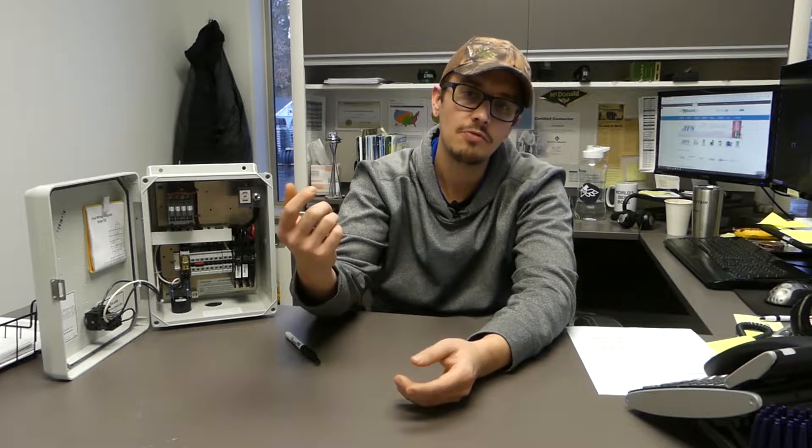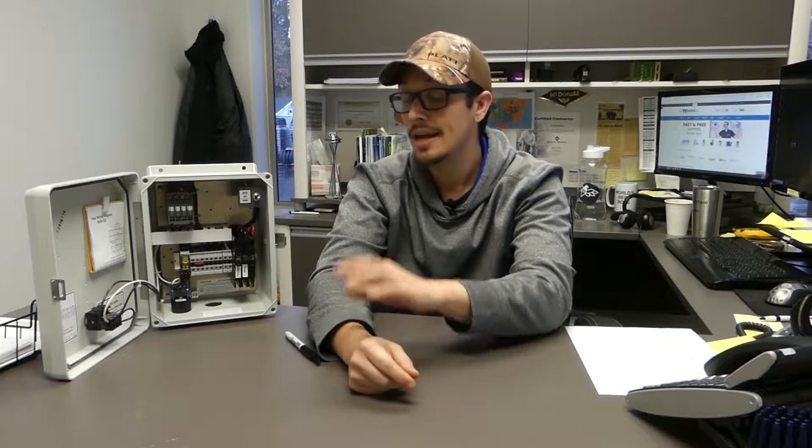Obviously if the control box is outdoors, writing on the exterior is likely going to wear away with time, but if it's indoors it's going to stay put for quite a long time. I would highly recommend putting amperage information — when you install new equipment it's generally best practice to take a reading of voltage, take a reading of the amperage, and write those down inside the control box. You could also write warranty expiration dates and pump model numbers so you know what equipment is in the septic tank, sump, or wet well.